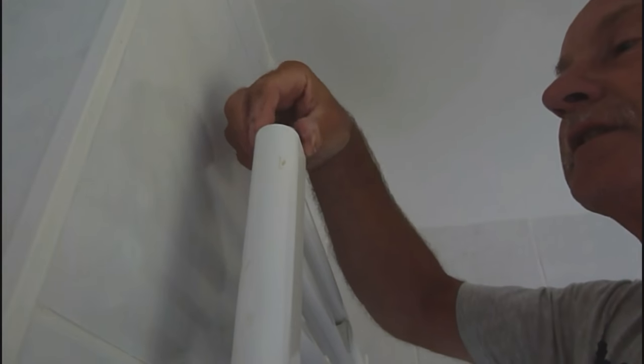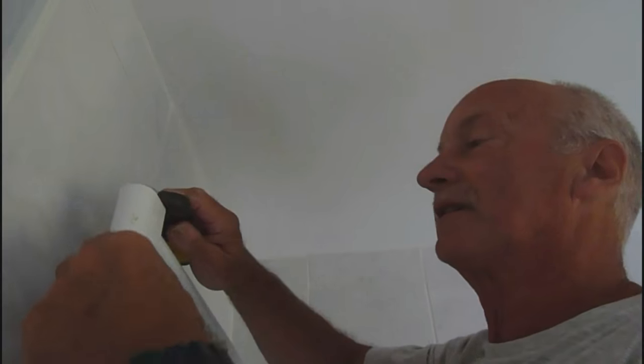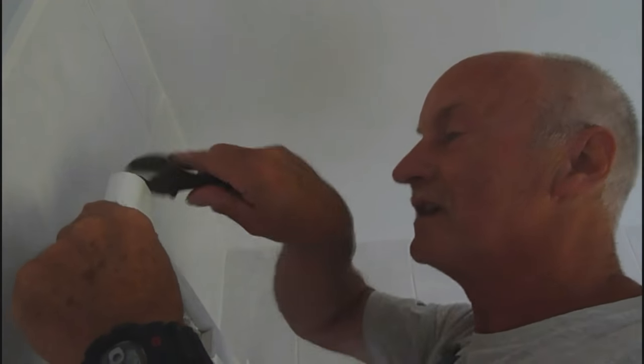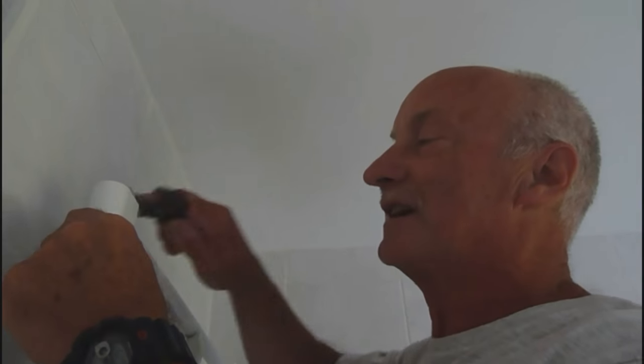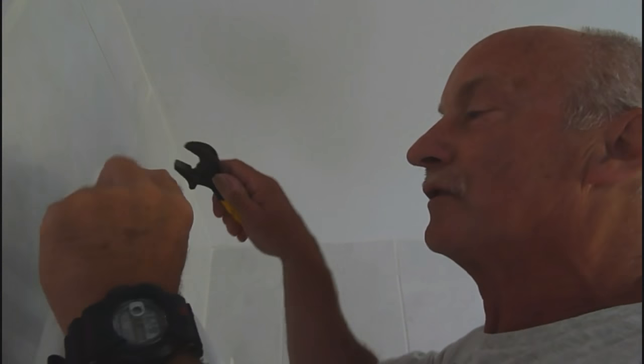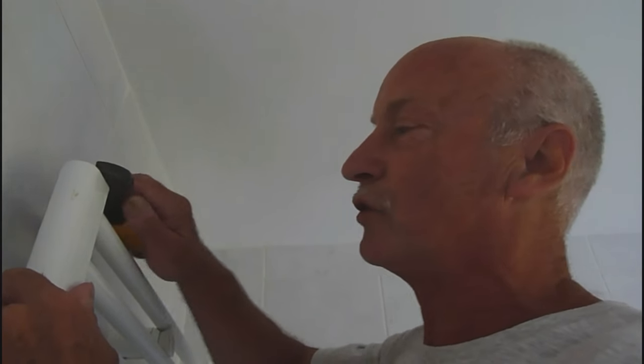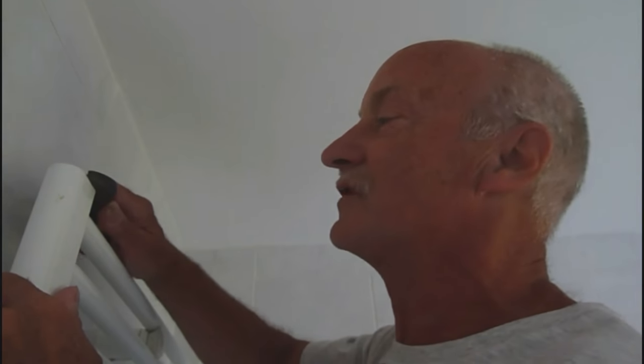Okay, now I'm going to put the new one in. So let's jump down a second, get our little bleeder here. That's what they look like, a nice little toy, and they're very, very good. So we're just going to screw them in the top of there. Mind the threads, mind you don't cross-thread them. Very easy, so do it steady. It's got a rubber washer on there already, so I'm going to put no seal on it, no PTFE, nothing. That's all you need, and just nip it in.